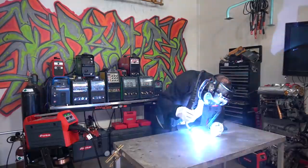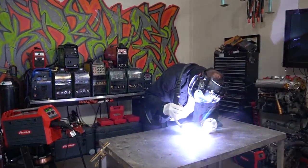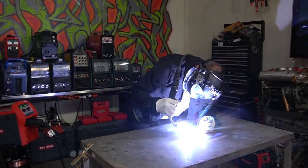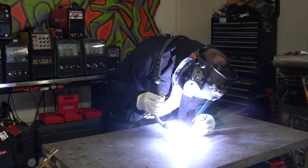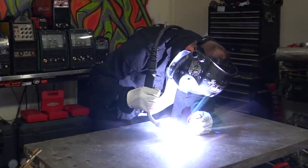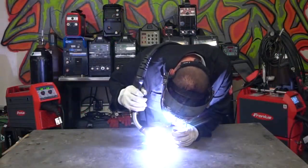Just for fun, I decided to run it just like a MIG welder. This would be the equivalent of a autogenous pass on stainless steel, and it's a lot more stable and a lot easier to run. But I'm sure with some practice it could be better. This is how I figured it would actually be easiest to run — it takes a little bit more body motion and movement because the MIG gun is a lot bigger than a TIG torch, but surprisingly it kind of made it a lot easier to do.